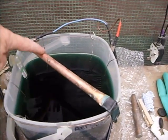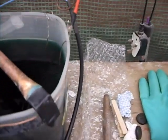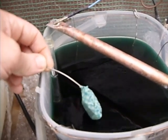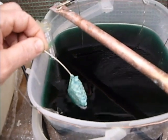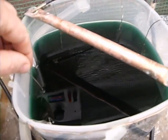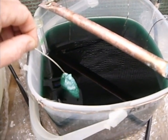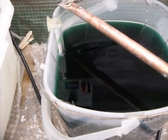Negative goes to the bus bar on the top, which you hang your parts from to be plated. Positive goes to a piece of copper wire that runs around the tank, and from that are hung the anodes on titanium wire. The reason for that is if you hang them on copper wire, you can't let it go into the solution because it will drag copper out into the solution. With titanium wire you can dunk them all the way in and use the full surface area.